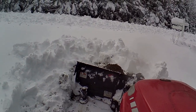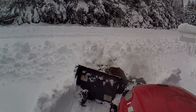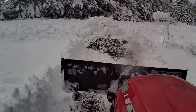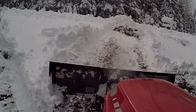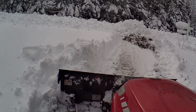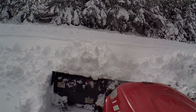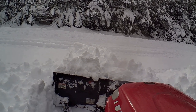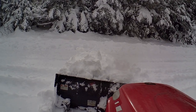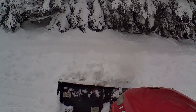No, I'm not going to get out with this one either. I'm using the differential lock and that helps a lot. This is a straight push and I think I get through this time. Oh, it slowed down — she's spinning a little bit there — but I managed just to ease off on the treadle pedal and keep the wheels going without spinning them, so I was able to get right across the road.